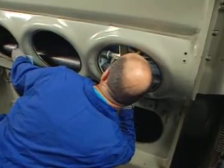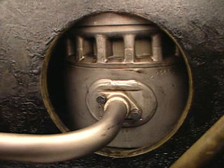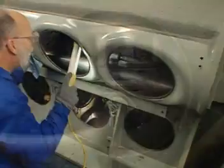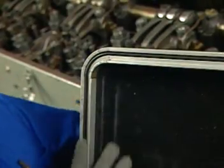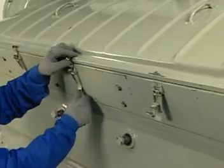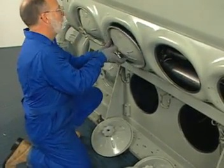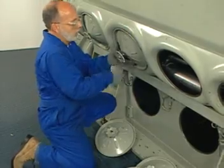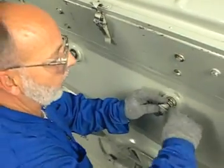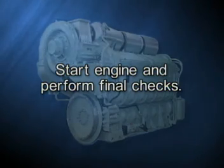Refill the engine cooling system with preheated water if available. Perform an air box inspection prior to start up to ensure that there is no debris in the adjacent assemblies, air box or manifold screen, and check for water leaks once the engine has been started. After inspecting the top deck cover seal for damage, position the cover onto the head frame and secure the holding clips and hinges. Check hand hole cover seals and check for damage. Apply all hand hole covers and after barring the engine one complete revolution, close all cylinder test valves. Set all applicable switches and circuit breakers or valves to on. Start the engine and perform final checks according to standard operating procedures.